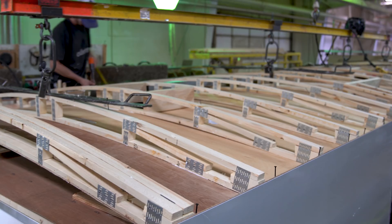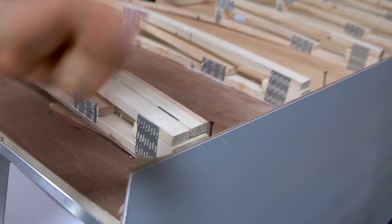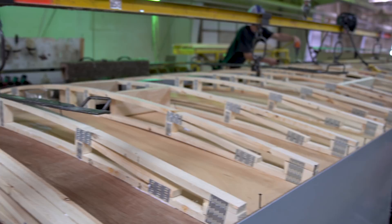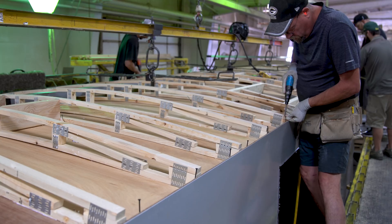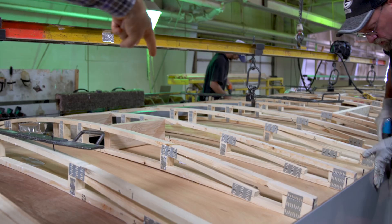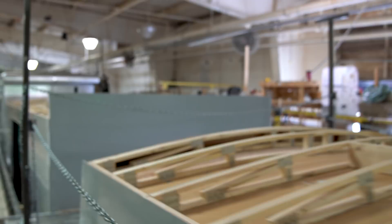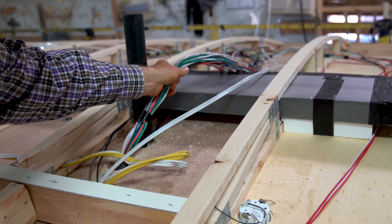You can now see what Dave was talking about — the fasteners going through here into that aluminum and into that wood tie-in stick. And right across over here there's the AC ducting going in. In this department, the roof electrical is all going in — right past this truss you can see a light being installed, then another light farther down, a plumbing vent coming up, and here's that wiring harness Dave was talking about, including a speaker.